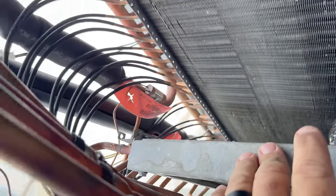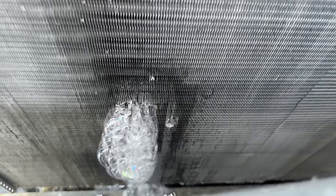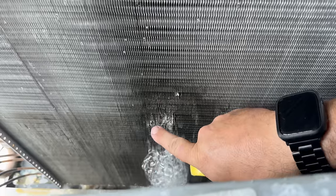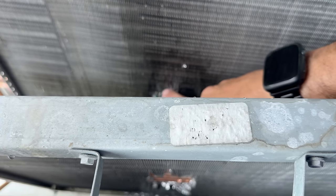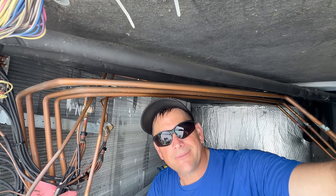So we yank this out — no choice because you've got all this piping. Horrible, horrible design. You can see right there it's actually in this coil. So that's what we're going to be working on. You can see when you spray this, it's happening in a couple spots. I'm hoping it's in this first loop here. If it's in the first loop, we might be able to get in there and yank out some of the fins, because this coil is probably $10,000 and it's not under warranty.